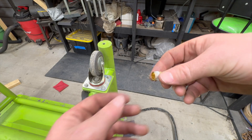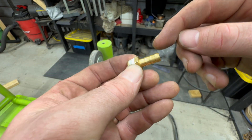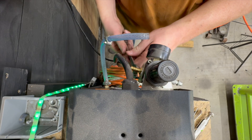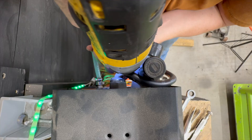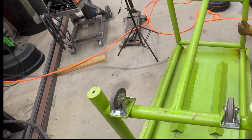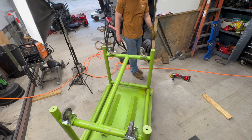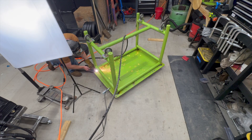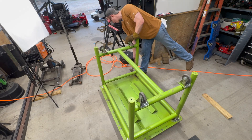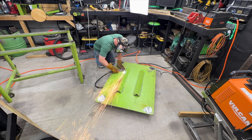I had some trouble with the back of my V-board - there was air coming out of either the threads or the pipe clamp. Quick fix with Teflon tape, tighten the connector all the way down, and we're back in business. There goes my plasma cutter - probably wasn't designed for that type of fall. No harm, no foul. Even with the plasma it wasn't easy. Had to break out the grinder, a hammer, and some serious yelling. Eventually got the plate off and started removing the angle iron stiffeners underneath.